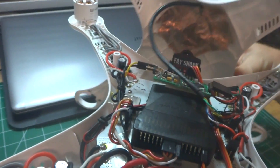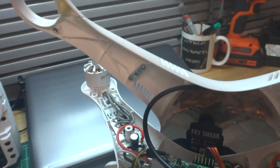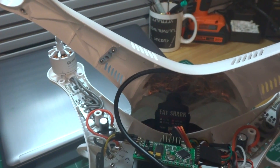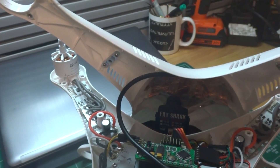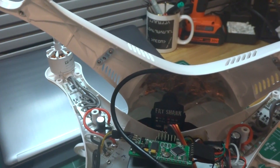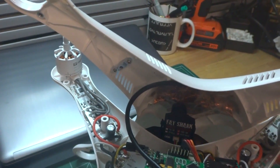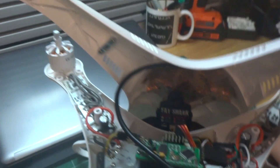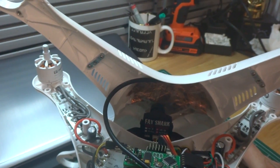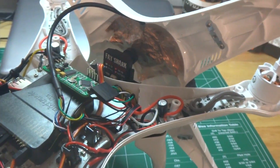I don't think I can overcome the compass interference problem without moving it to a separate module. I found one for APM but it doesn't work for Pixhawk — all the Pixhawk modules I found are either combined GPS+compass or GPS-only. I know the 3DR Solo has a compass module in the leg, so I'm going to look for one of those. That said, I've done a full motor calibration and minimized the problem for the most part. Flight performance is phenomenal — I have really strong altitude hold and position hold.